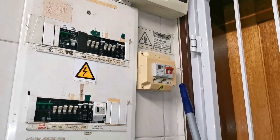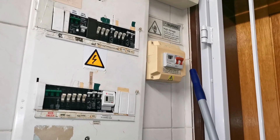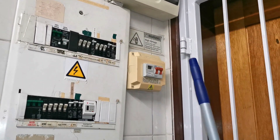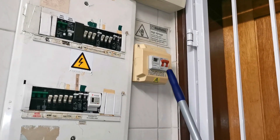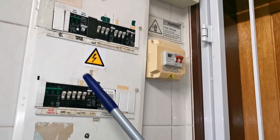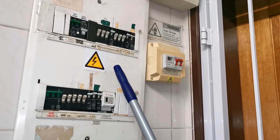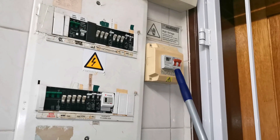What I asked my electrician to do was also install a manual changeover switch for loads that I would like to use when it's a nice sunny day, but wouldn't normally use if it's cloudy because I don't want to put strain on my inverter. Under normal circumstances those loads are all being supplied by utility power from Eskom all the time.